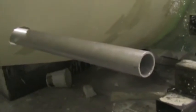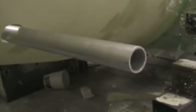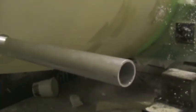long. And that tube is going to go into the wing at the rear attach point, as you can see there. That hole is approximately 300 millimeters from the trailing edge, but you must make it to suit the exact position of your rear bulkhead in the fuselage, which was fitted earlier. You need to cut a 1.8 meter long piece of this 38 millimeter OD aluminium tube. It's the thick walled one of 3 millimeters that's going to pass through the fuselage at that position. It will ultimately be attached to this rear bulkhead in the fuselage.